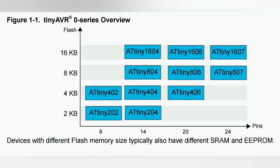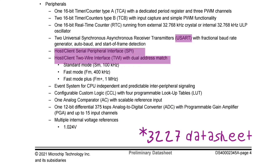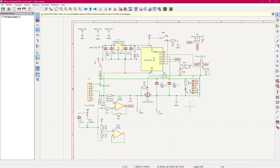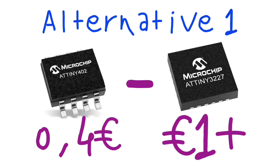Here are the numbers of pins and flash memory you can get — there are different combinations so you can find a perfect one for your project. ATtiny have I2C, SPI, and UART, and can run from as low as 1 MHz or lower, which is useful if you want to operate from batteries and need low quiescent current. One of my first PCBs used an ATtiny402 for overcurrent protection for 4S lithium-ion batteries. Those ATtiny cost from 40 cents to a little more than 1 euro.